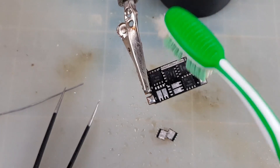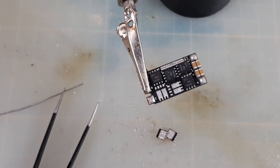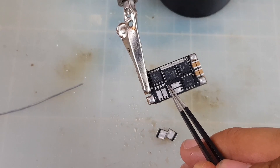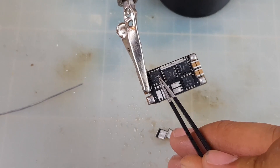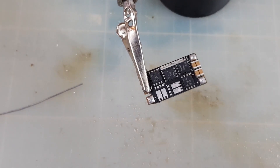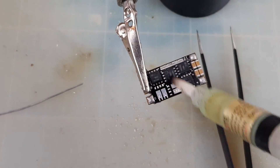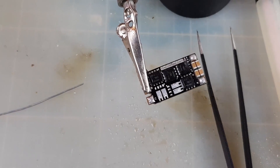It's really recommended to take a picture before you begin so you know the correct orientation of each MOSFET. I can see the little dot on the chip — that dot corresponds to the dot marking on the PCB pad, so when I place it, it comes down just like this. Both pads have these dot markers for alignment. Now I'm going to add a bit more flux and then add solder with the soldering iron.